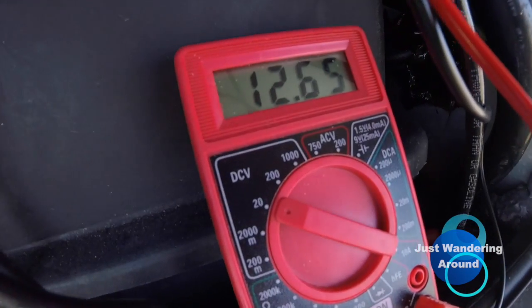As soon as she shuts off the vac system I'm going to see how fast the batteries recover. It's staying at a consistent 12.42 volts while the vac is running. She just shut down the vac system — there was obviously a load on the batteries — and now we're up to 12.65, 12.66 volts and holding steady. So it was at 12.42 on account of the constant load, but now it's recovering.